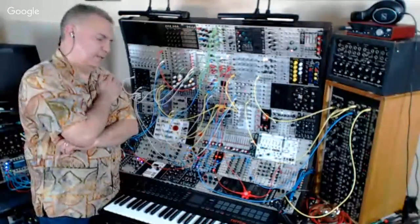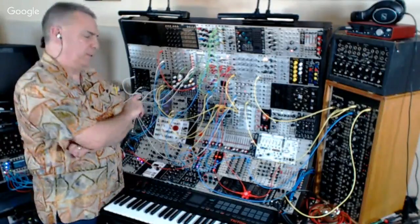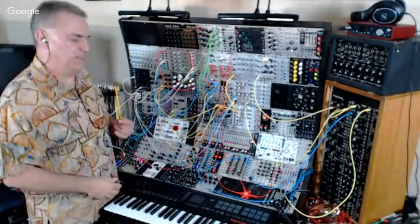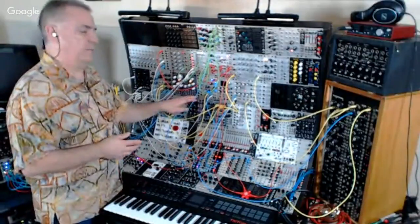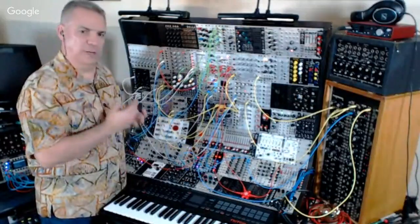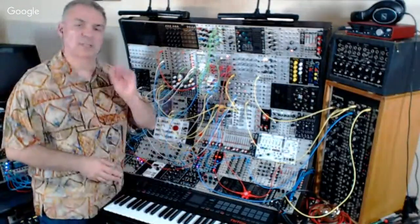And a personal taste, and this is personal again, is I prefer linear FM, and virtually every oscillator has exponential FM. Only a few have linear FM. They have to be marked as having that, because it allows me to stay in tune across the keyboard, to have some modulation in the sound as I play up and down the keyboard. Exponential, if you're enveloping it, you can get out of tune with it. Exponential FM is wonderful in a static sense. I'll use exponential FM with one oscillator driving another, but no VCA in between them, and come up with some really great, powerful, throaty sounds. But if I want to envelope that modulation depth, and I do because I like pluck sounds, I like horn blips, things like that, then it's got to have linear FM, so it's something to look for.